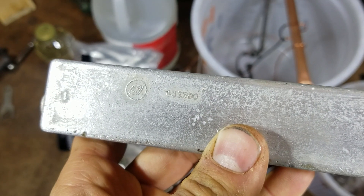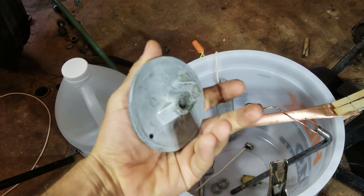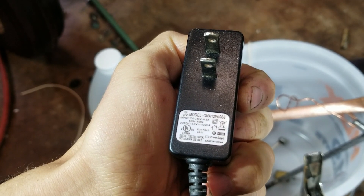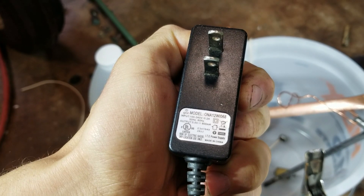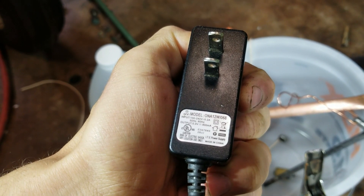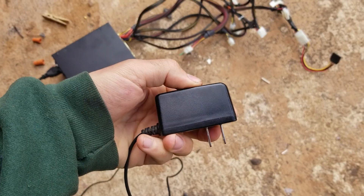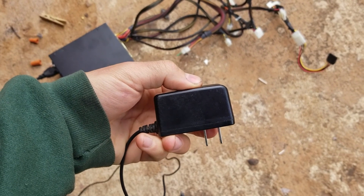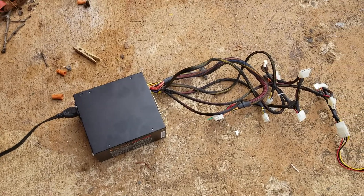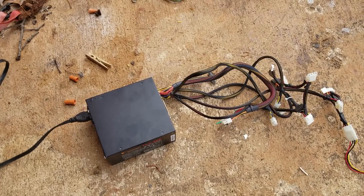Here's a part number if you want to get this exact one. You can also use one of these off of an outboard — it's an anode down there by the exhaust. We need a power supply. This one's 5 volts, 800 milliamps. You don't want more current than you need, and you don't want more voltage than you need. It's all based off the surface area that you're plating. I'll put links in the description where y'all can calculate all that. This is just a little wall wart. If you're not plating much, one of these little power bricks will work, but this thing only lasted about an hour for me and then died. I had to break out the big computer power supply with 5 volts — that way it's constant volts and constant amps. This is going to work way better.